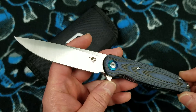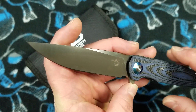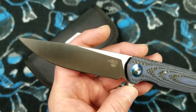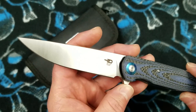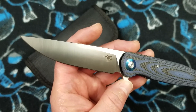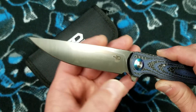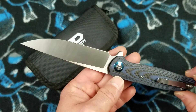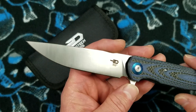Material wise, you're looking at what is now becoming the classic premium steel for the budget arena — D2 tool steel. It is a very basic tool steel with very high carbon content and high vanadium content. It does have a high chromium content, but it misses the stainless qualifier by a percentage and a half, meaning D2 will stain and it will rust, but it is not like a straight-up carbon steel. It takes a moderate amount of care.